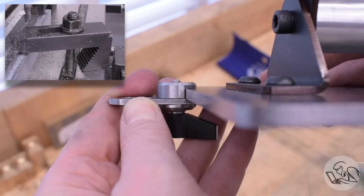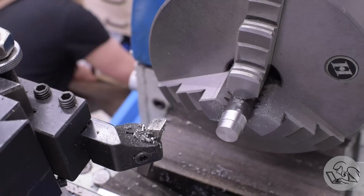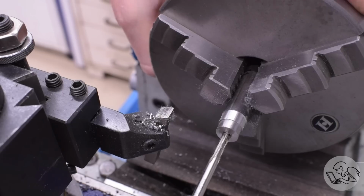Keep this shape in mind if you ever want to design your own clamps. You always have to have these three elements. You've got the heel, the clearance area underneath the threads, and then the toe area where the clamping is actually happening. Next up is a T-nut that rides in that track that we did at the top of the show.